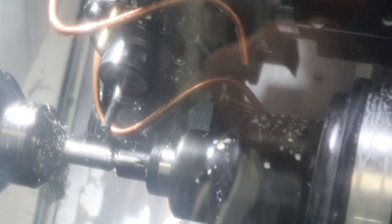I'm going to do a couple passes dry for you guys — you don't really want to machine titanium dry, but I'll slow it down. I picked up a bird's nest at the top of the tool — it tends to do that, but I don't think it's a problem. You can see the chips flying towards the camera. Imagine if we had perfect clarity with no window — that would be great. Now I'm going to turn the coolant on. Watch the window.